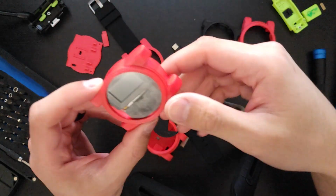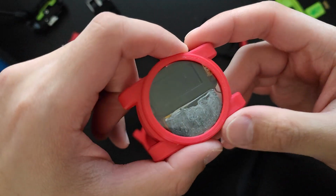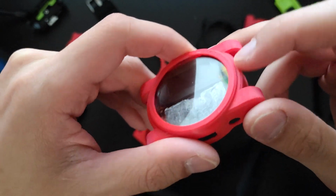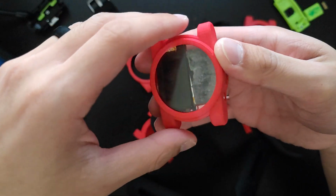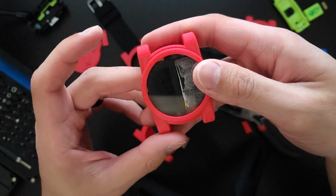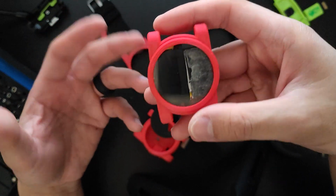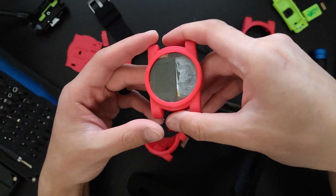But PLA just looks really nice, and you can get a pretty good surface quality on it. Like this here is pretty decent quality. It's not the best thing ever, right? You can still tell it's 3D printed. But if people want to sand this thing down, or polish it, or do something to it, PLA is overall more rugged. It's easier to work with. It's easier and cheaper to mass produce. Even a nice PLA is still cheaper than getting a decent PETG material.